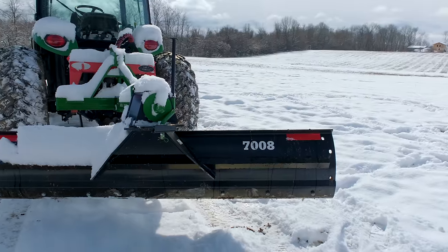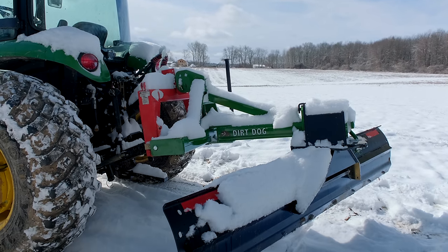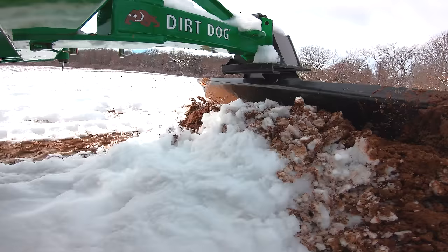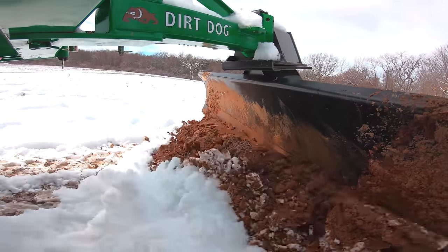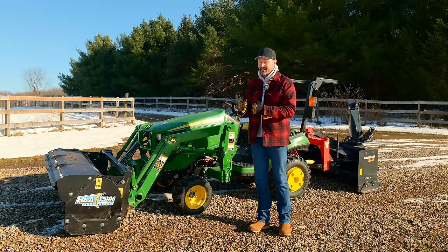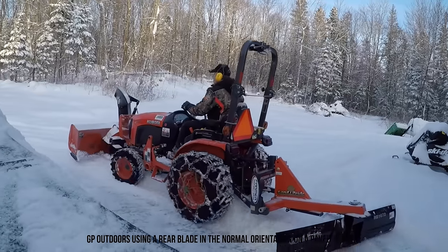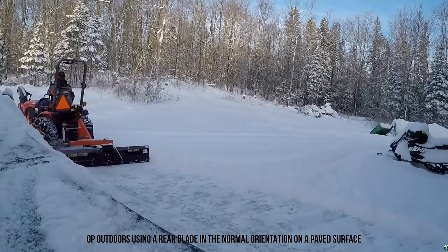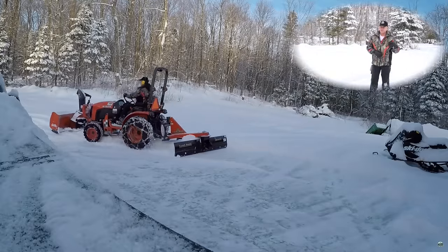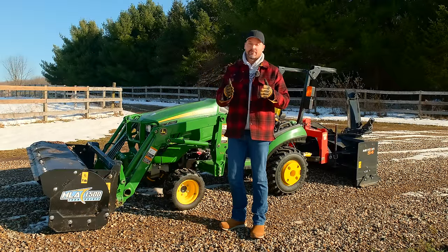You can spin a rear blade — oftentimes you'd angle it to push snow or dirt to one side of the tractor. But if you completely 180 it, spin it around so that the curvature is facing away from the tractor, it doesn't want to dig in and grab the gravel. It just kind of glides along — the weight holds it down. That's going to be really good for those times in the season when your gravel is not frozen and has a tendency to want to leave the driveway. I think that could be a really affordable and clever solution without doing a lot of driveway damage. Then when things do freeze up, you can spin it back around to the traditional orientation. A lot of the rear blades we sell — I think the 72-inch and larger — have holes pre-drilled so you can add skid shoes to help prevent sinking down into the stone.